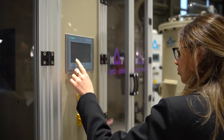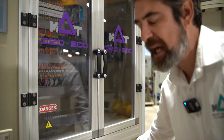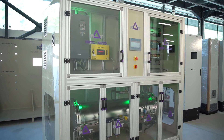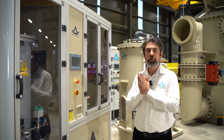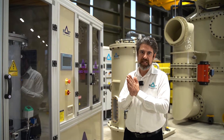Here we have a PLC control system and all necessary measurement components. Underneath this cabinet, we have the necessary transformers. Our generator comes as a single body, including all necessary control components, corona reactors and transformers. It is also possible to provide, as optional, water coolers, water chillers and on-demand oxygen generators.